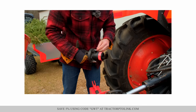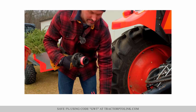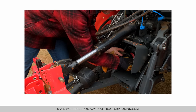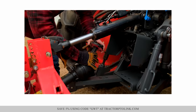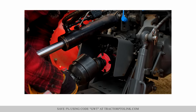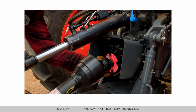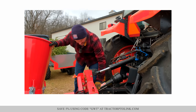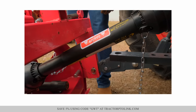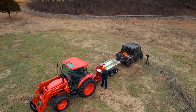We had this setup working on our small tractors, and every tractor is a bit different on how the back end is configured — the three-point hitch, how far it sticks out, if you have a quick hitch or not, and the length of the PTO shaft to get back to the spline output on the tractor. It turned out we did not have enough PTO shaft overlap. The PTO shaft is two pieces that slide in and out as you raise and lower. We solved that by adding the PTO link, which gives about five extra inches of length to get back to the minimum overlap.